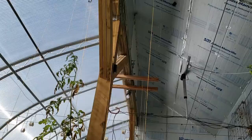But since the end of November, I turned that system off because they don't really need to vent. Our days were short enough that the climate battery was able to keep up with cooling. But really, by mid-February, it's no longer able to do that. No matter how cold it is outside, their days are long enough now, the sun angles are right, you get more heat than you can store. So that's when I start using the vents.